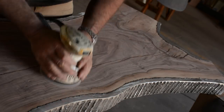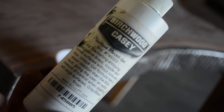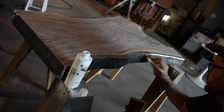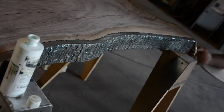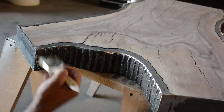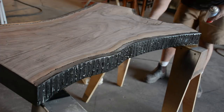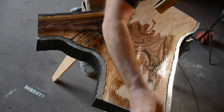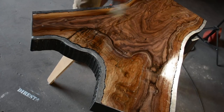Now I'm preparing the wood using a heavy grit on the belt sander and following up with the palm sander. There were a couple of burns on the top which I just left. I'm applying a Birchwood Casey blackener on just the outside steel. I went in with the grinder to clean off pebbles and bumps from the welds and got everything to at least a medium height. The blackener does its job immediately, and anything that spills over the top raw metal edge I palm-sand off later. Then I'm using polyurethane on the top.